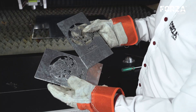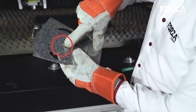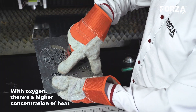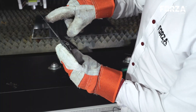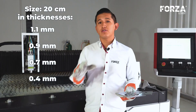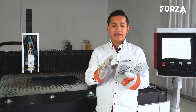At 2mm and 1.5mm, the size of the details is much smaller, which causes heat concentration. This concentration generates a kind of melting at the edges. Therefore, when using oxygen, it's already difficult to make small details because the heat concentration basically causes them to melt. We can clearly see the difference when working with large pieces versus very small, intricate details. The cut on the outer edges or borders is absolutely perfect because the piece has ample space to effectively dissipate the heat. However, in the finer details, we unfortunately start encountering these inconveniences when making the cuts.